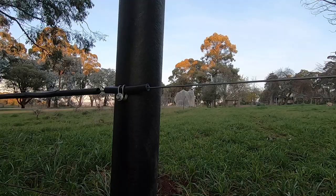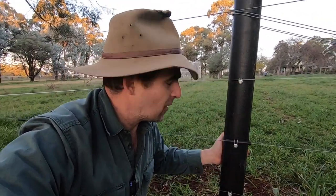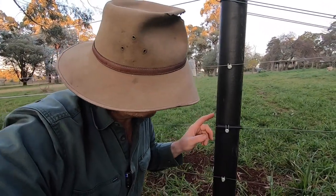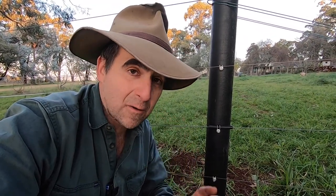So I love this — we've got a small family-based manufacturing business in the west of Victoria, working out of a shed on a farm, producing a product that could revolutionise the way that we attach wire to posts. The Davos fencing clips not only allow us to use new products like the wood shield post and achieve 100% waterproofing, but also allow us to do away with expensive insulators on posts and use something that's a lot more secure and stronger long-term than a piece of plastic nailed or screwed into your post. The one improvement I think we could possibly make is to maybe spiral cut these insulators so that you can put them on electric fences after they've been strained up. But using these steel clips to attach wires to posts for cattle, horses, and sheep — it just makes sense.